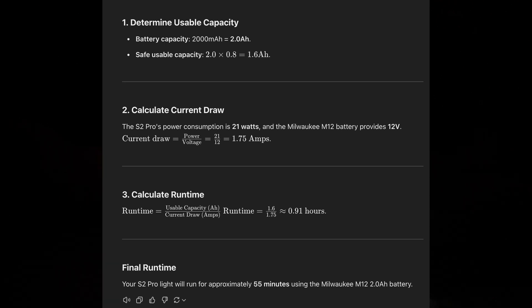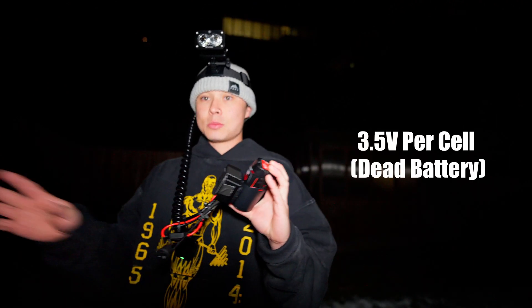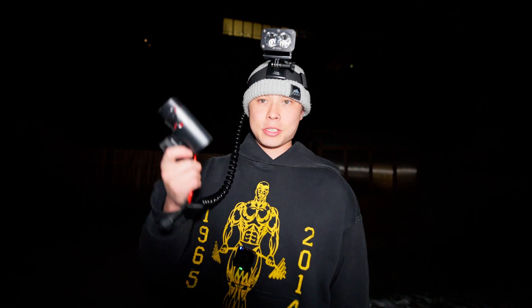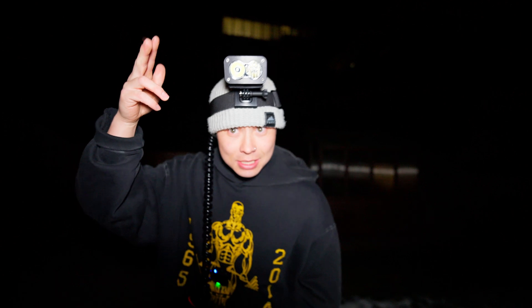This is a Milwaukee two amp hour battery, and I did some calculations — this battery should get me about 55 minutes. I have this low voltage cutoff set up so that it turns off at 10.5 volts, which is 3.5 volts per cell. You don't want them to get any lower than that. It starts at 12.6, so it goes from 12.6 down to 10.5. I haven't tested it yet, but it should be about an hour — not exactly what I was hoping for. But I do have a lot of these batteries, they're super quick to charge, relatively cheap, and I can use them for all my tools — so it is a good investment. I really like this light. It's super cool. It looks like I'm a freaking crazy Megamind head, but it is really bright and works really well. Thanks for watching — check me out on the next one.